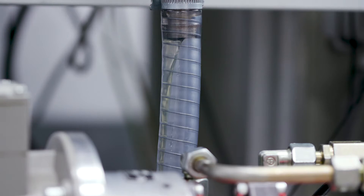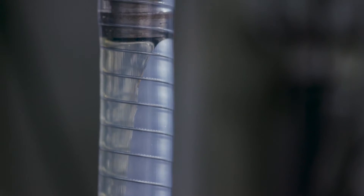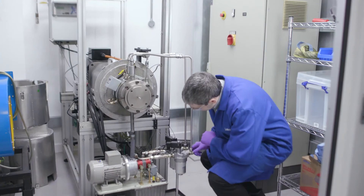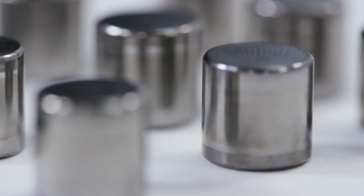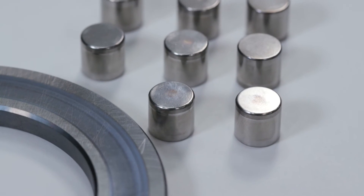So it's just metal on metal. There's very little lubrication film, which means the additives have a lot of work to do. We run these bearings for 80 hours, then take them out, weigh them and see what weight they've lost. The main components assessed are the rolling elements, and the spec allows for 30 milligrams generally across 15 rolling elements, which is 2 milligrams per element.